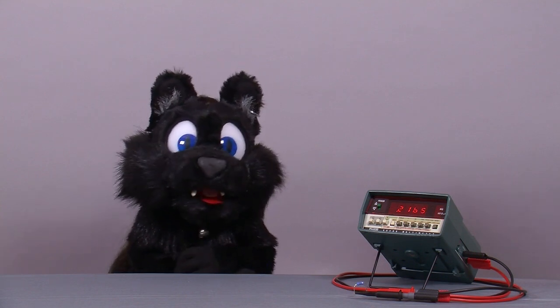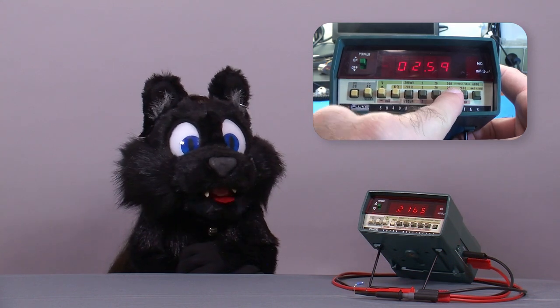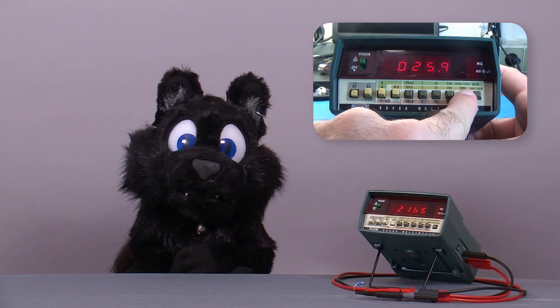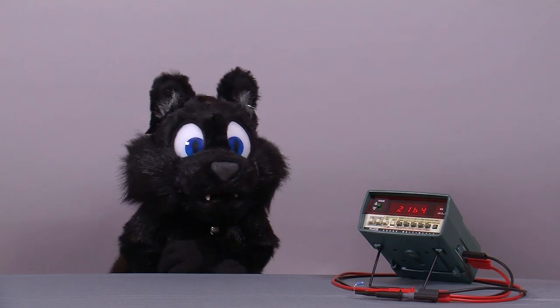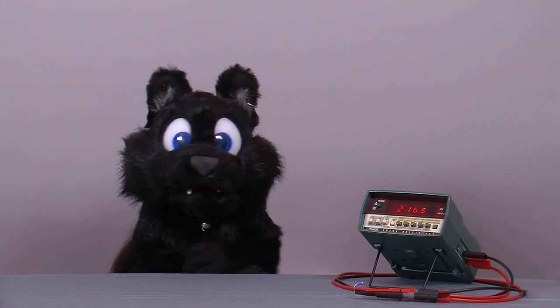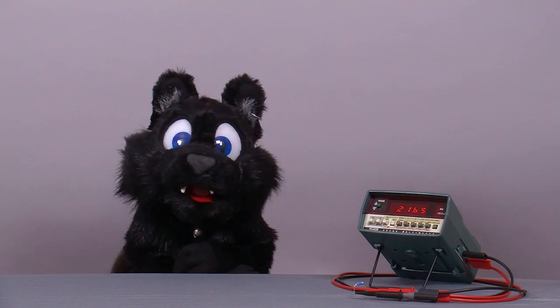I did give it a quick try. The display was showing weird values, especially the leading digit, which was flickering, and it emitted quite a bit of buzzing noises. So some components were clearly in need of a tune-up. Also, the buttons were quite a bit yellowed.